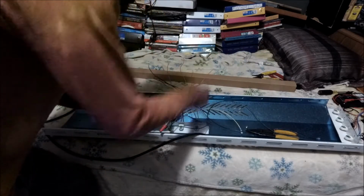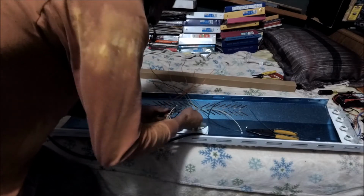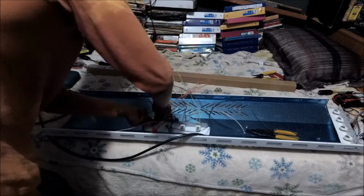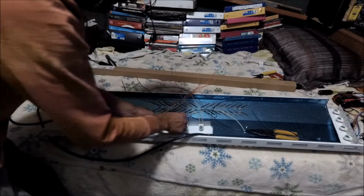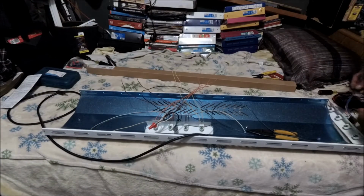Because once everything is in, you don't want anything to come loose, and then you have to unscrew everything and do everything again, and it's just a waste of time. So check every conductor. These, push them in. Make sure they're good. For the tombstone, your individual conductors in the tombstone, all of these are good. So now we can attach it. We already checked this one, so we can attach it.